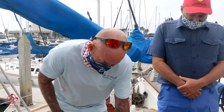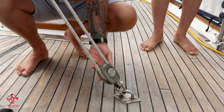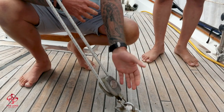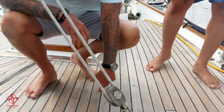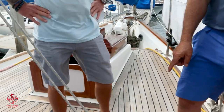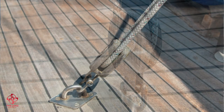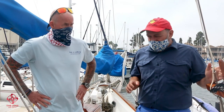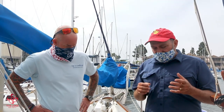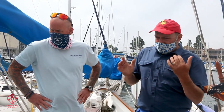One thing I want you to notice — look at these wooden blocks. I mean, that's just so awesome; this is nautical history. That's what I love about these classic boats. Two things: yes, it retains the look and nautical tradition of wood boats, but this block was put on when the boat was new in 1987 and it works great — the gear is fine, the bearings are fine. I've got a few Schaefer blocks on the boat that burn out after five or six years because the plastic gets beaten by the sun and the bearings go — it's newer technology, lightweight, and it doesn't last.